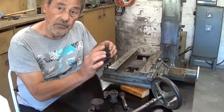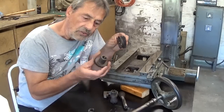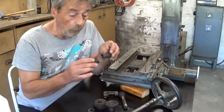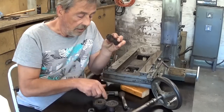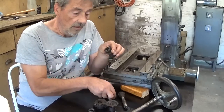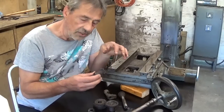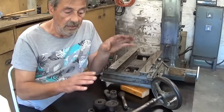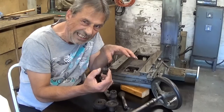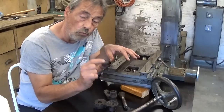Between the teeth of all these parts, everywhere are big parts of junk stuck between. Like for example, this beautiful double little gear. There is a slotted finger here that makes it move, but because of the rust, it didn't move anymore. It moved in one direction a little bit, but not in the other one. The shaft and some of the gears look a little bit as if they were overheated. What doesn't make any sense at all, because these are very slow moving parts.